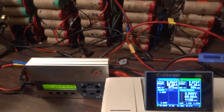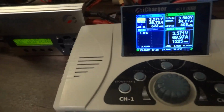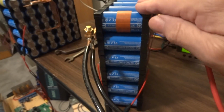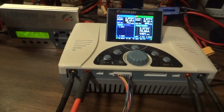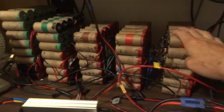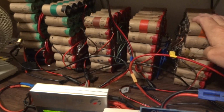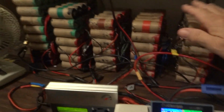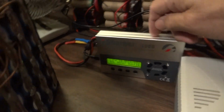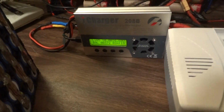When this discharges this battery to test it, and I want to test the capacity, that's the whole point of doing this, in the second part of the next video it's going to put energy into the iCharger, which will put energy back into this battery bank behind here. However, there's a lot of inefficiency and we're going to lose energy. So that's why you have to have this 10 amp auxiliary charge. And then over here I can monitor the whole process.